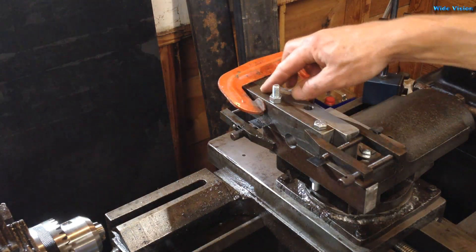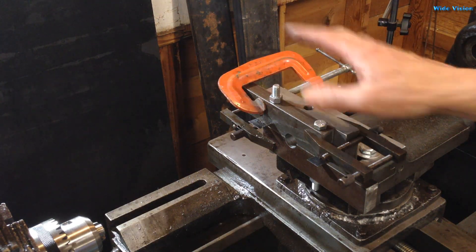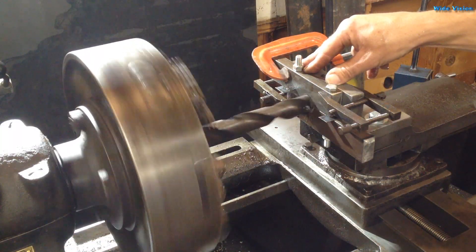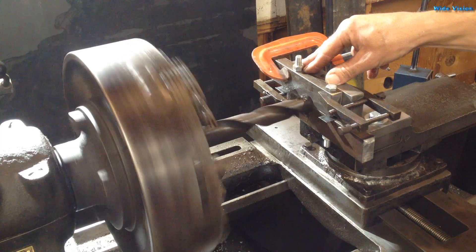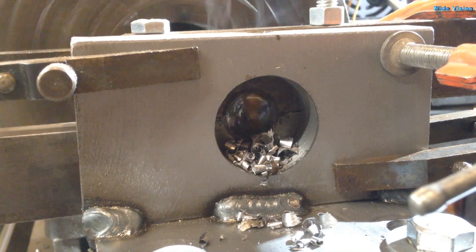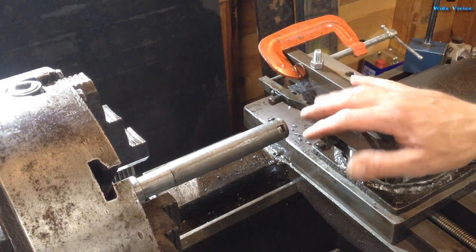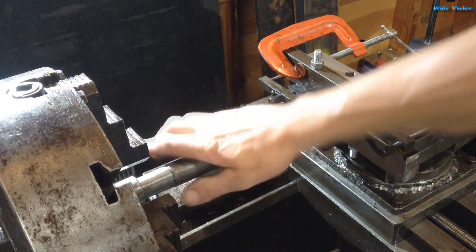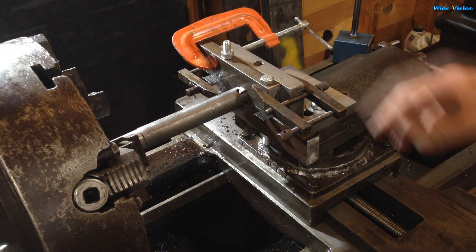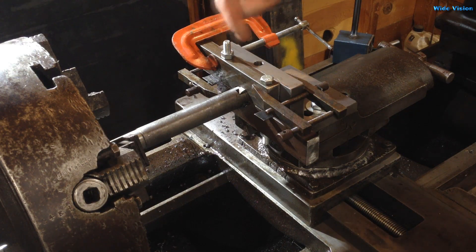Added another clamp. I just felt like it was moving a little bit over here — I had my hand on the compound feeling that and it didn't feel rock solid. I debated about which boring bar to use, but I decided to use my Morse Taper 3 boring bar. I'm still running at 90 RPM. I thought about kicking back up to 250, but it's an interrupted cut so I'm going to go slow. I can't decide if going slow or fast is good for an interrupted cut.